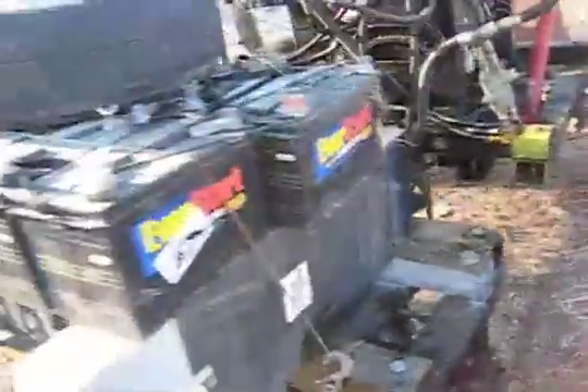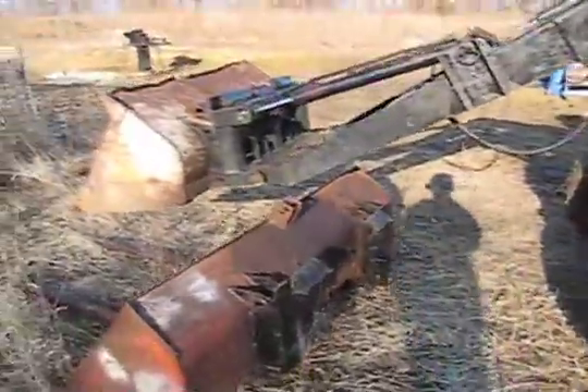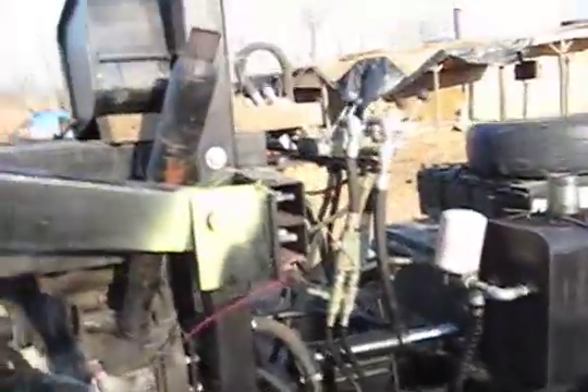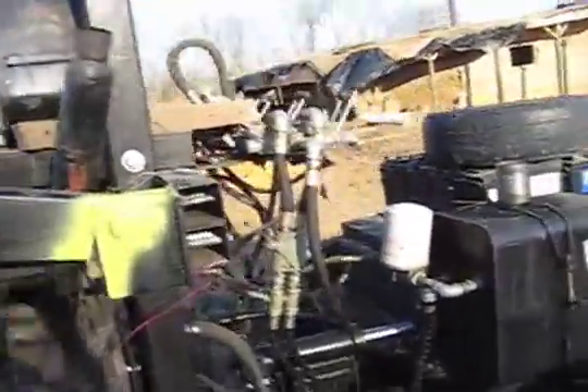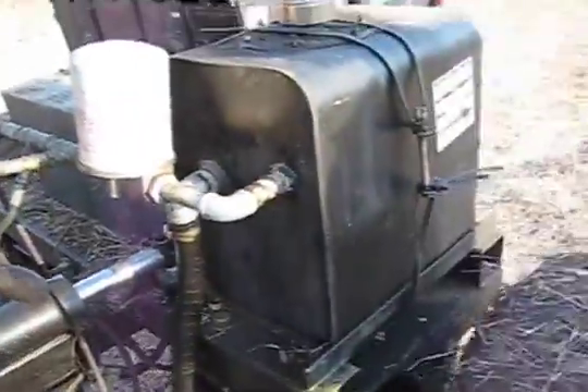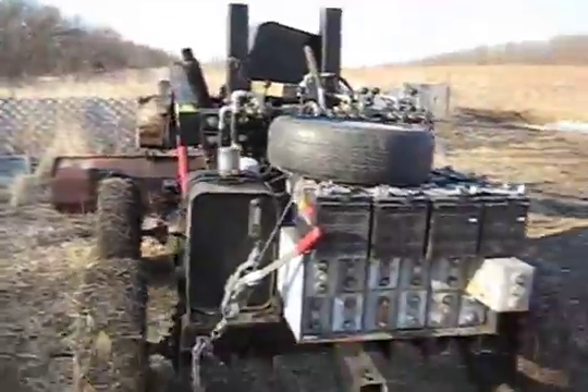We've got a big weight in the back because of poor weight distribution. We put on 1500 pounds of batteries on the back to keep the weight distribution proper, because even with heavy loads the back wheels come off the ground. Right now everything is in a makeshift position. Here's the hydraulic cylinder that actually does the steering by pulling in and out, rotating the back wheels to make the proper turning without skidding on the ground. Here's the hydraulic level in the tank right there.